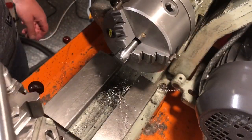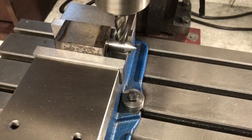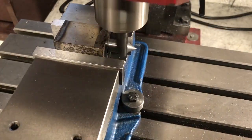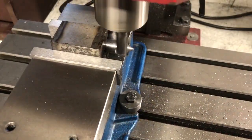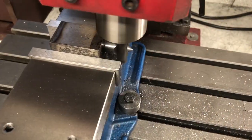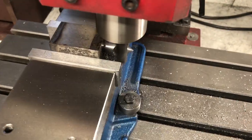With the turning complete, it is over to the mill to form the half centre. We are set up in the vice in a v-block, and the plans call for this to be relieved 1/16th short of half way. The material is half inch, so that means I need to remove 3/16ths of an inch. This isn't a particularly critical dimension, but we are looking to leave a complete cone of about 1/8th diameter at the point. So I'll touch off, and I will be plunging the cutter before side milling to the end. Having the part in a v-block up against the fixed jaw, rather than hanging out of a collet block, really helps with the rigidity of this setup.